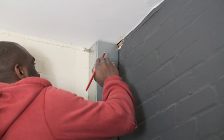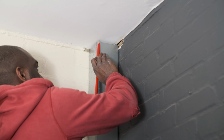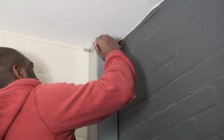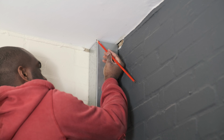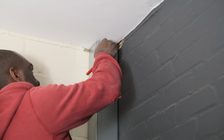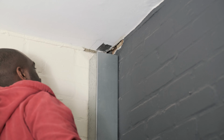Once all that's done, I traced the outline of the trunking to prepare cutting the plasterboard of the ceiling, the thing I've been dreading this whole time. Note that I'm making a slight mistake here as I'm tracing using bare trunking, when I need to account for the coupler and more specifically the screws that will protrude from it.